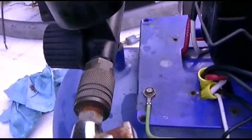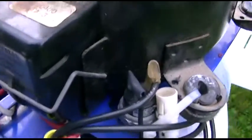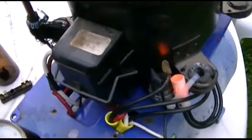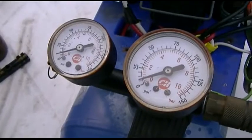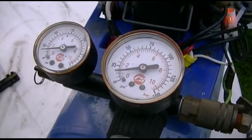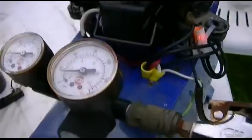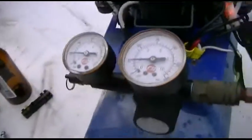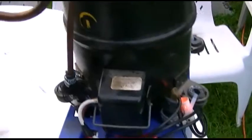I put the ground wire on the tank, tucked the wires in, heat-shrank that. The other one was actually the original from the dehumidifier. Shoved the light in there just for shits and giggles. And we'll do one final run-up of it. And she's on. It's not fast, it's not slow. I honestly don't remember how long the original compressor on this tank took to fill it up. Anyway, this is the final run-up of it, and then it's going to go in a corner in the garage.